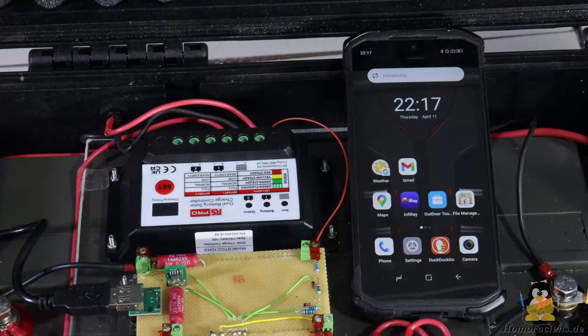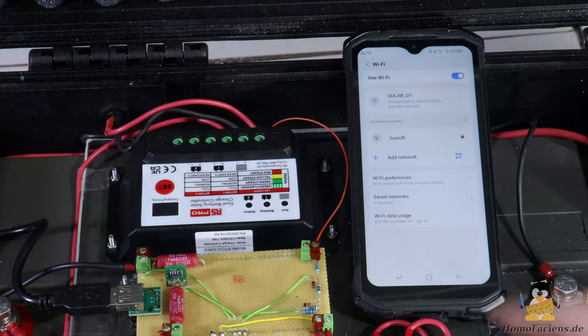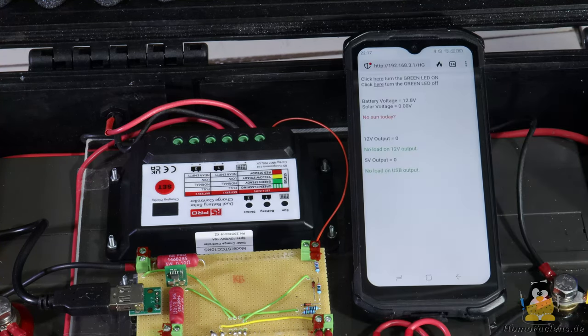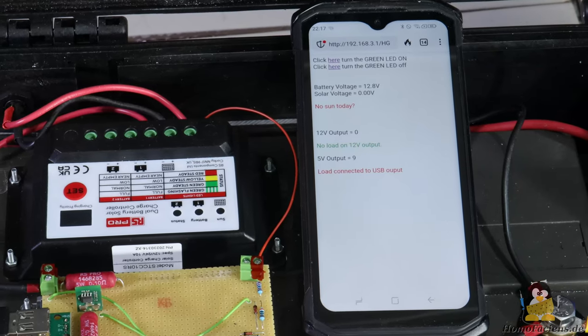The nominal total power of the solar panels is 120W, which under optimal conditions would take 12 hours to fully charge the 12V 120Ah battery without losses. The Arduino records how many hours pass under real conditions. Using 100mΩ resistors as current sensors and by monitoring the voltages on the battery and solar panels, the charging process and the electrical power drawn can be monitored.